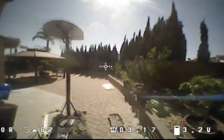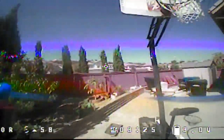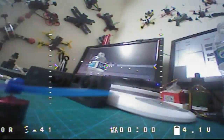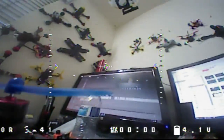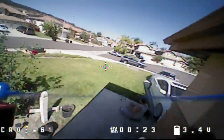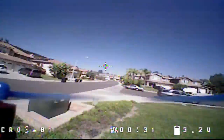The picture quality was decent — about what you'd expect out of a micro CMOS camera. Not the best when it comes to detail, but that's really what you'd expect from these cameras. The picture was bright, but then again it was sunny out. As far as the 25mW VTX goes, the reception was actually really good. Even with obstructions in the way, I noticed very little noise, and this was from me flying from inside the house. I did change the OSD readouts from stock — it was just a little too cluttered. Things like the artificial horizon looked cool at first, kind of like you're in a cockpit, but in all honesty it's more of a distraction. It's slow to react to your stick movements and really just not ideal for mini or micro drones.